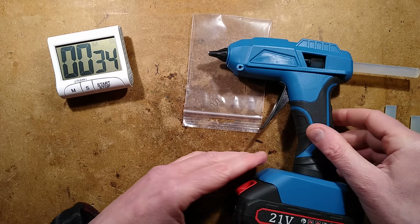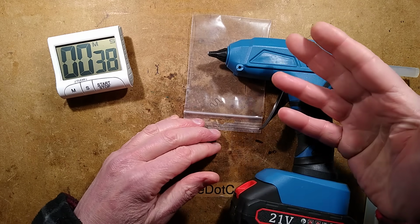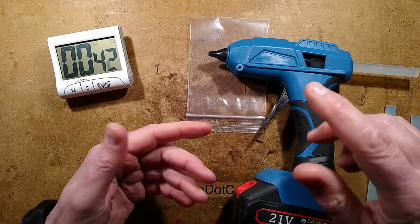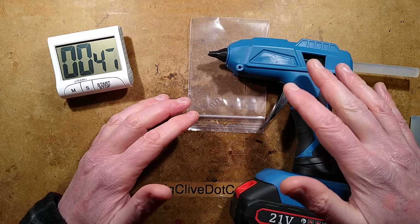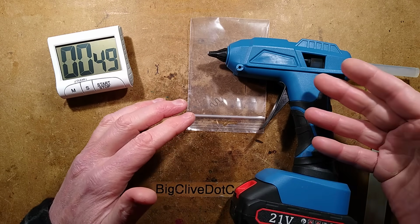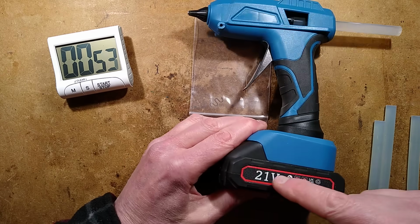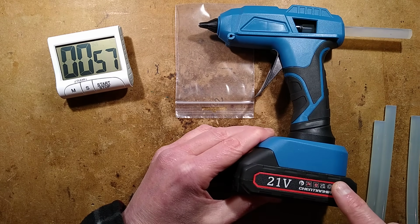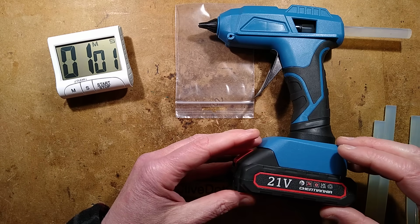Now, something worth mentioning. I thought Makita batteries would be intelligent and maybe have protection against over discharge, but the only batteries I've come across so far that do that, well, the ones I've taken apart, are Ryobi, which have built-in protection because they're backward compatible with the NiCad tools, and the clones. The clone batteries are actually better in a sense because they will shut the power off if they detect that the voltage across an individual cell is going low.